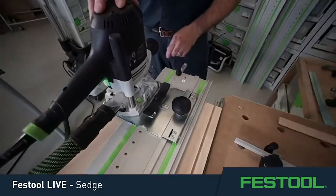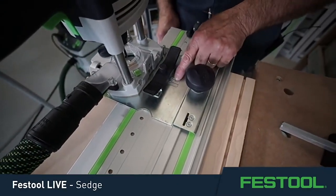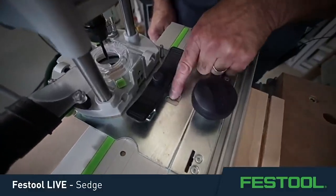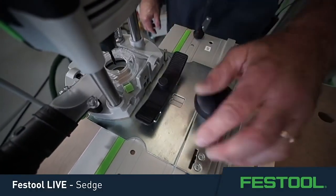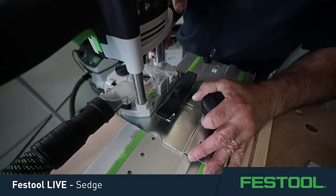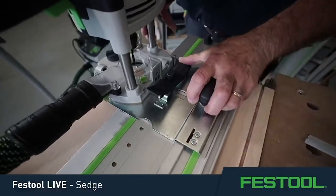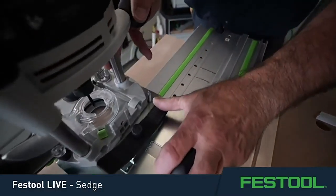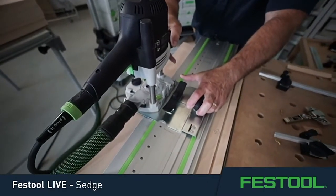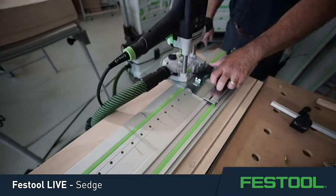I check my depth. Make sure the turret hasn't moved. I'm going to check my marks. Okay? And you see that right there? That's my viewing window. That's why I marked the rail there. Now, also, Chris, while you're right here, see this right here? When I start to go to these, I just lift it up out of the hole. I let it find its equilibrium. I like to use my thumb. So when I go over here, I make sure I let it, because that's how I used to skip, but that pin is riding right in between.